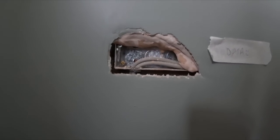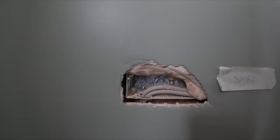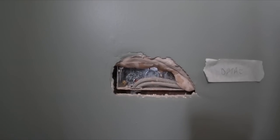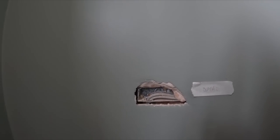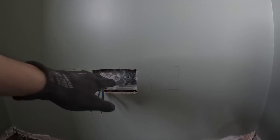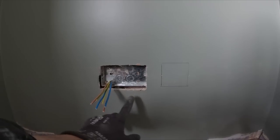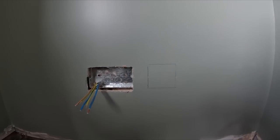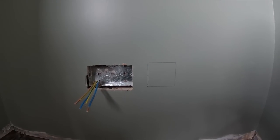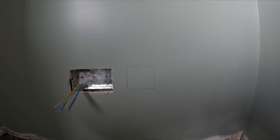Coming down to this one — as you can see, there's a gap between the bottom of the box and the plasterboard, so that's going to be fun. The customer will probably have to put some filler around that. I'll chip out this one and then cut out a box to the left, pick this board up and try to run a data cable across. So I'll show you before and after I've chiselled out all the plaster, stripped it, and got it ready. We know about this bit of damage where the plasterboard's been cut in the wrong place.